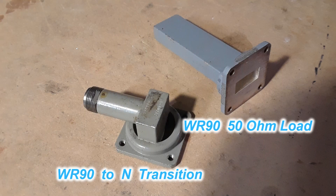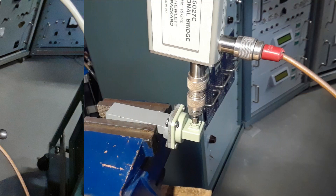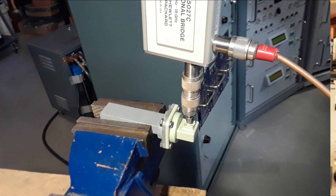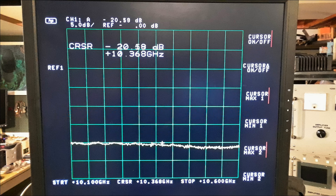A lot of the waveguide parts I got from other ham friends. This transition piece here uses an N connector, which I found was going to be lossy and it didn't tune up very well either. Then I got another transition piece from the waveguide to an SMA connector, which is really what I wanted for this application, and when I swept it, it was much better. This is the return loss at 10 gigahertz, which is right around 20 dB down, whereas with the older N connector type transition piece it was only maybe 12 dB down.